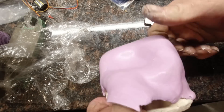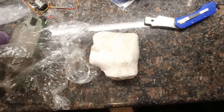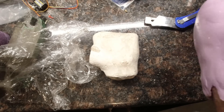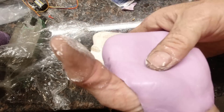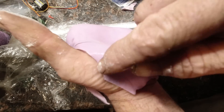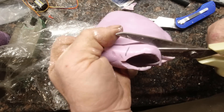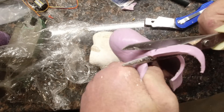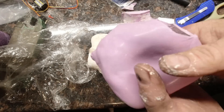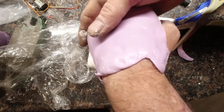It's really important that the liner fits comfortably and doesn't rub or cause any discomfort when it's on your hand. Now that the glove fits nicely, I put the plaster back into the silicone liner and made a wax mold of the outside of it so that I can make a plaster form to lay up the fiberglass hard socket that the silicone liner should fit snugly into. After the hard socket is made, I'll turn a new set of dry contacts that screw together to fit into the glove. There's a link in the description to the Amazon listing for the silicone I used for this project — please click the link so I can get credit on my Amazon affiliate account. I hope everyone is doing well — be sure to like, subscribe, and share the video, and leave a comment to let me know what you think. Thanks for watching.